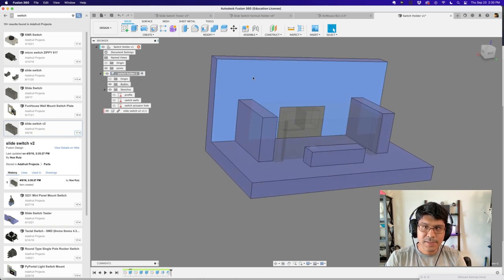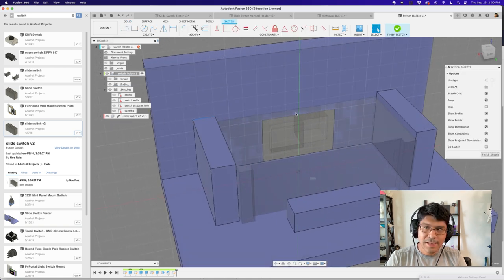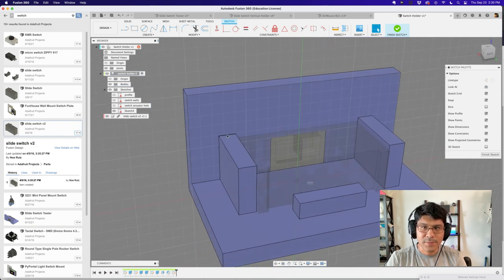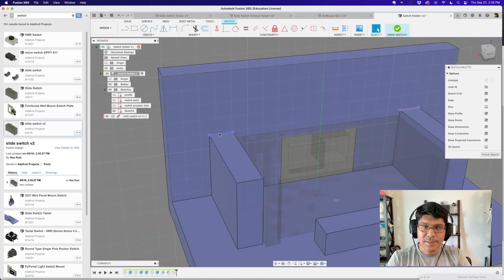And now I'm going to click on that, select that surface, create a sketch, and I'm going to project in this line and this line. And that'll just make it easier to kind of snap to it. So I'll select those two, hold down shift, select that one, hit the hotkey P, which is the project hotkey. You can see here geometry is 2 selected. Remember to keep that projection link selected, hit OK. Now I got my 2 purple lines.